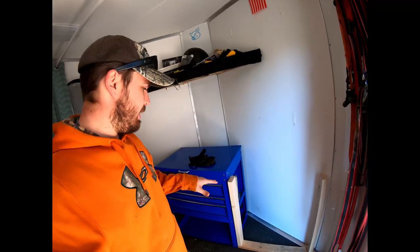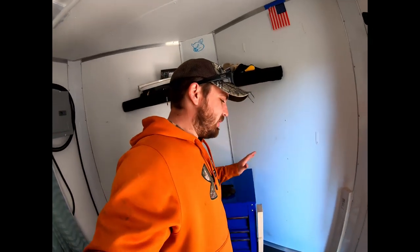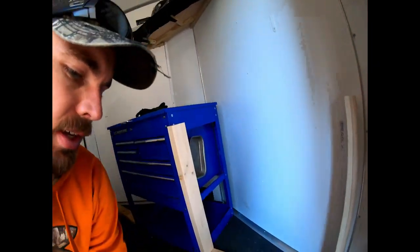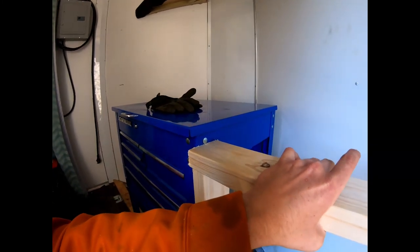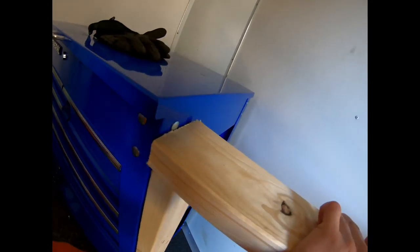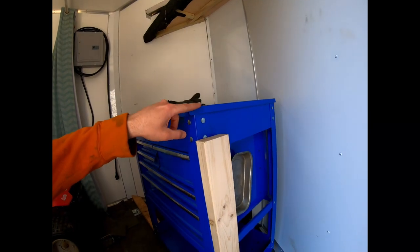I took a pause break and had to recut the boards, because I am not a carpenter. I'm all right with tools, but we had to cut again because I didn't realize that when I put the two-by-four up here and measured, then put the plywood on top, that lip I want underneath there. Before, it was above, which would cause the plywood to hit it and you wouldn't be able to open that. Just a little snag in our design here, but we're cruising.